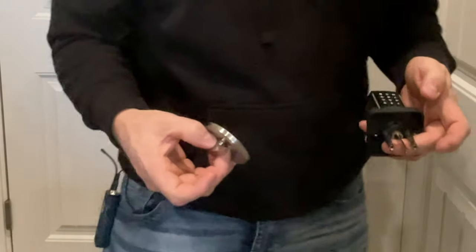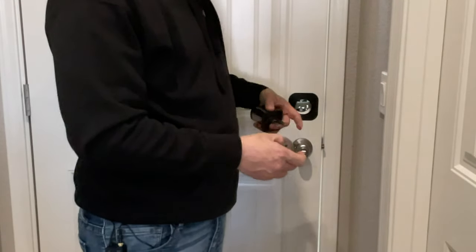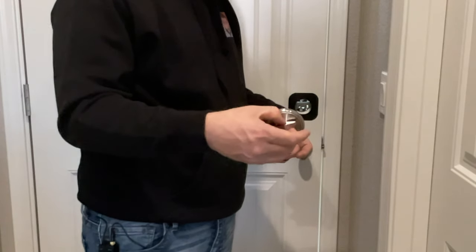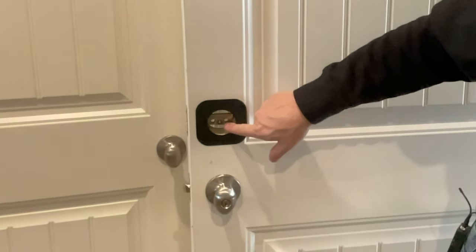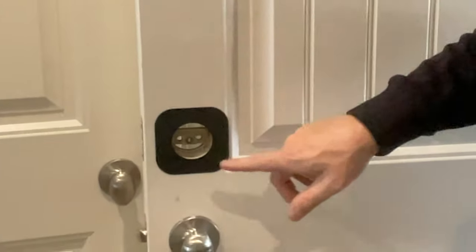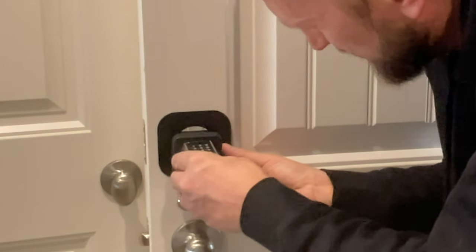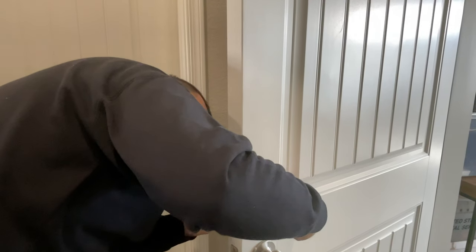This part of it — if you want it to go on the outside, it has to go on the back side of the door; if you want it to be on the inside, it's got to be on the inside of the door. We want this to be on the outside so when you're coming into the door you have to type in the passcode. This one's just going to be a mechanical latch so we can open and close it manually. If you look down on the side of here, you can see where we're going to try to line it up — the center piece runs to that latch and the two bars on the outside are going to fit right through the holes.